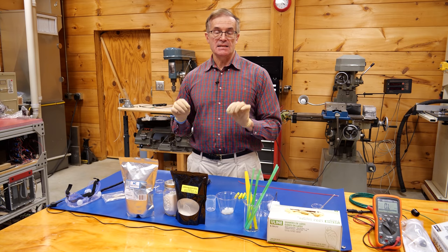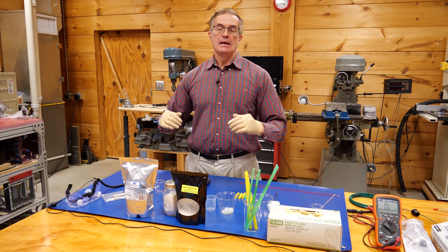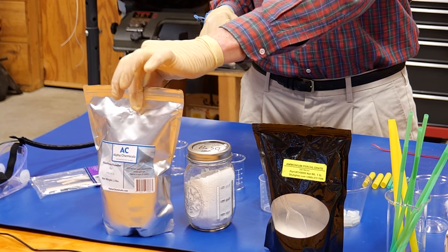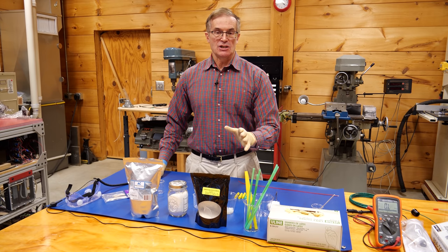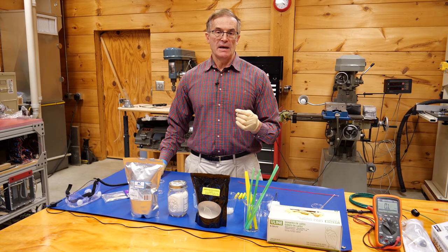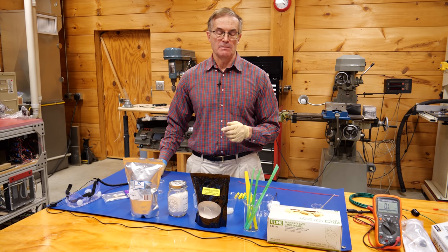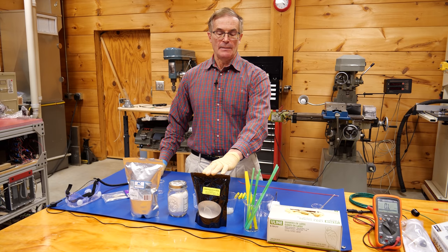Make up the least amount you need for your project — you don't want to make up a huge tub of this and store it, because this stuff is extremely flammable. The materials are very simple: ammonium perchlorate, aluminum powder, and barium sulfate. These come in different mesh or granular sizes. When building a composite rocket engine, you'll use a 400-micron particle size — it controls burn velocity and allows you to pack more oxidizer into the matrix binder. For pyrotechnic mixtures, 200 microns is more common — it's a little easier to blend and it's widely available.